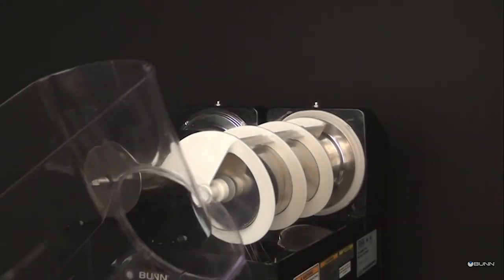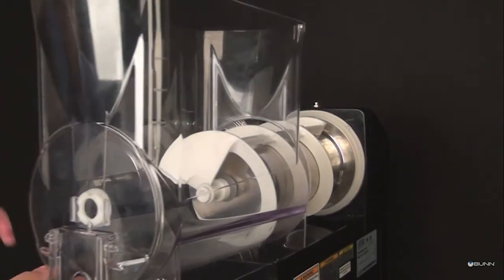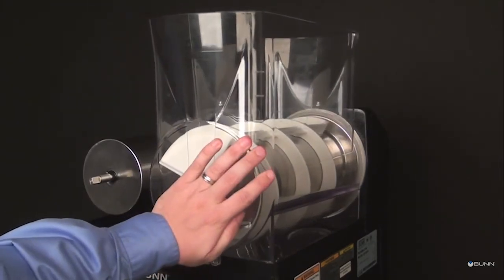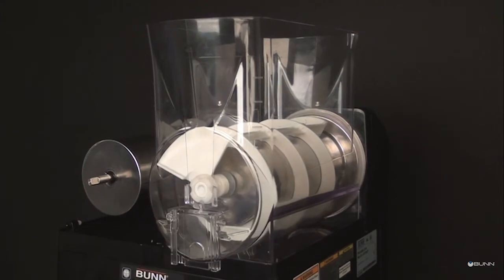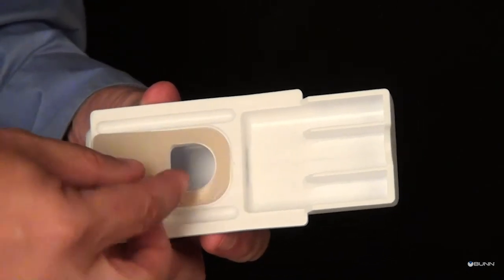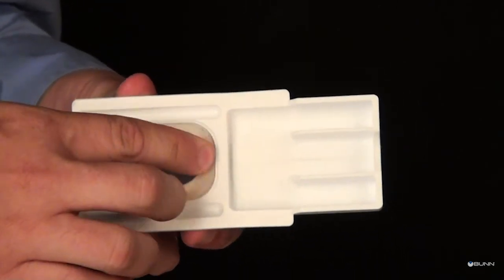Thoroughly rinse the hoppers and install them over the augers and cooling drums. Slide the hoppers into place and push down until the hopper lock plunger snaps into place. Insert faucet seal into the faucet valve, and then install spring.